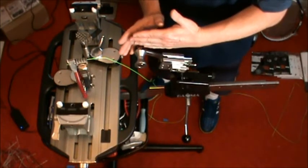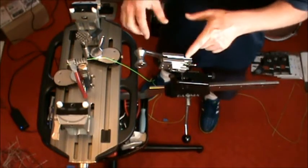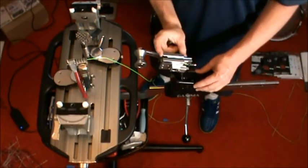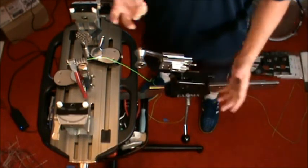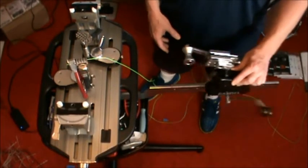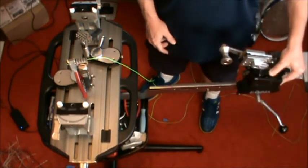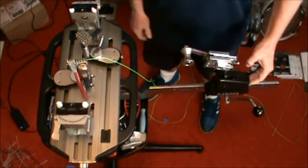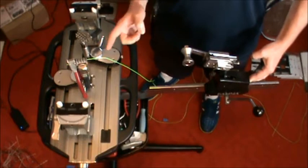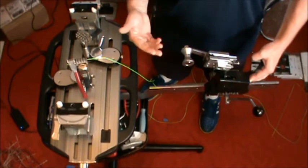You can bang it into the frame. I've seen lots of frames that have damage on them, usually near the throat, from where someone has spun a racket around and it has whacked into the gripper on a Neos or a similar machine. So if you have a Gamma machine, it's a very good idea when you're using your crank to engage that knob so that this will stop at the same spot every time. This will give you more consistency because again, the string length going from the racket to your tension head remains the same every single time.